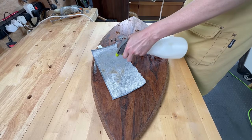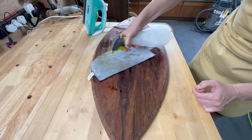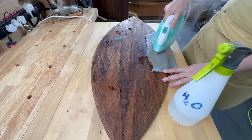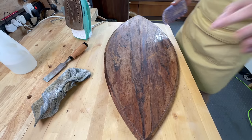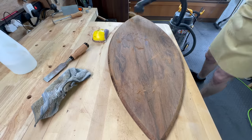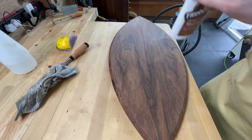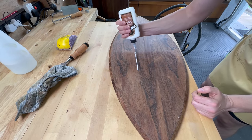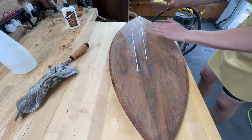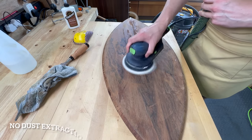When you think about it, this is what plants do — they transport water from the roots to the top. That's what happens when you apply water to wood grain: it absorbs it and expands. Even though it's not alive anymore, this still works. So when you have a dent, you put in some water, add some heat to make it quicker, and it expands and raises the grain, making it easier to sand so you don't risk sanding through the veneer. This way you can fix quite a lot of scratches and dents.